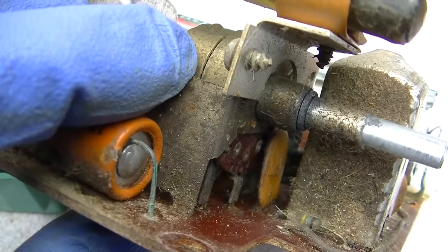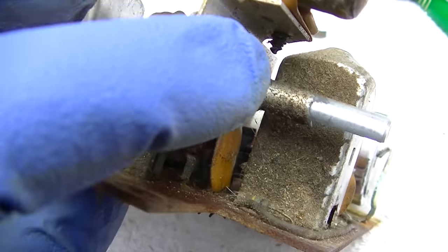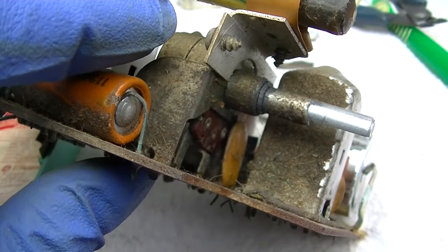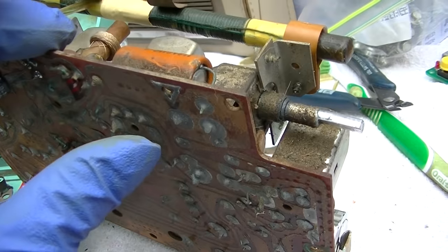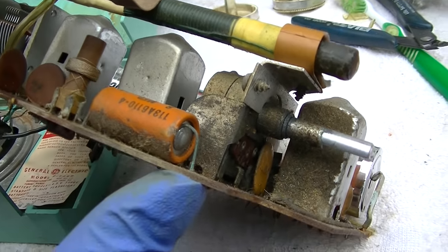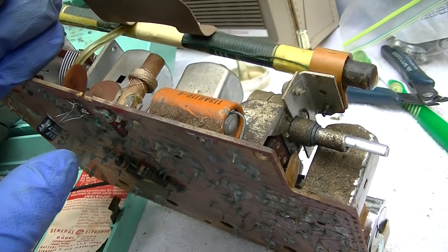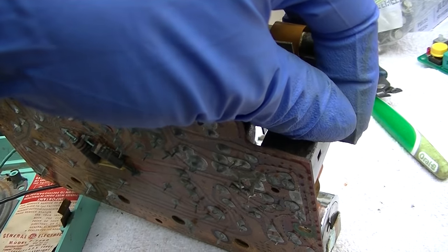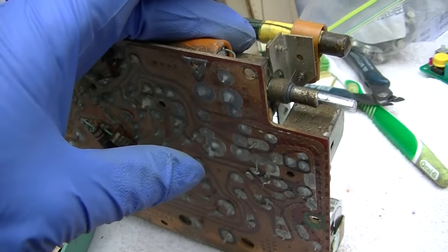That's almost a deal killer. Yeah, this is a specialized volume control with the power switch on the back. It's almost a deal killer with this radio. Probably be cheaper and easier just to buy a new one off eBay. GE made a billion of this style. I mean, that right there is basically the same. It's almost easier just to buy a new one rather than screw with it. We can try and pop a silicon transistor in here and play with the bias just for entertainment value. That could probably be replaced with a lot of work, but yeah.